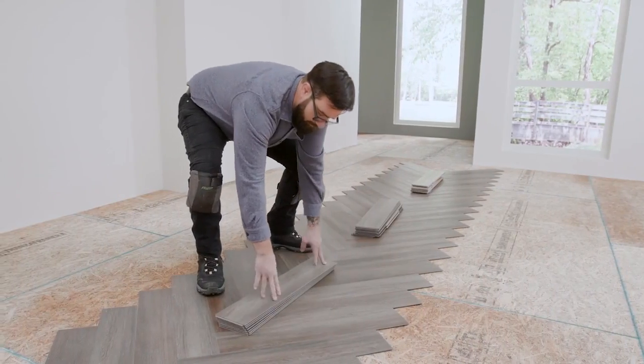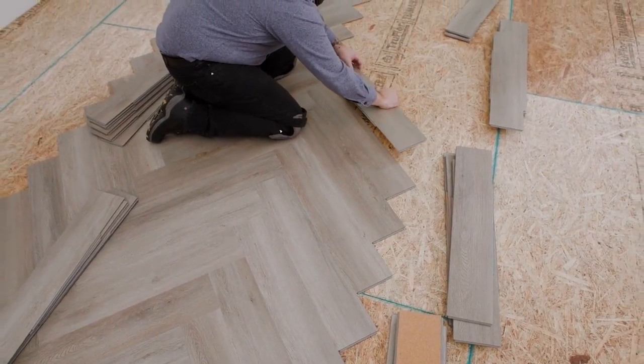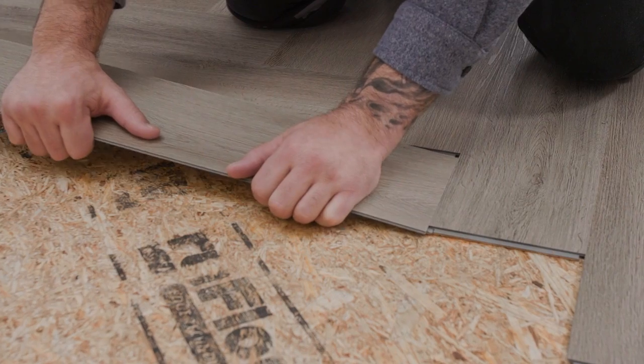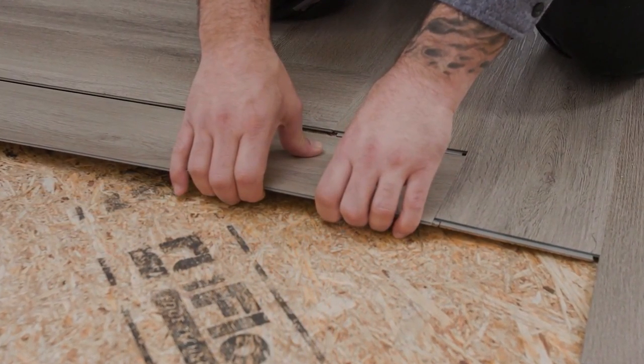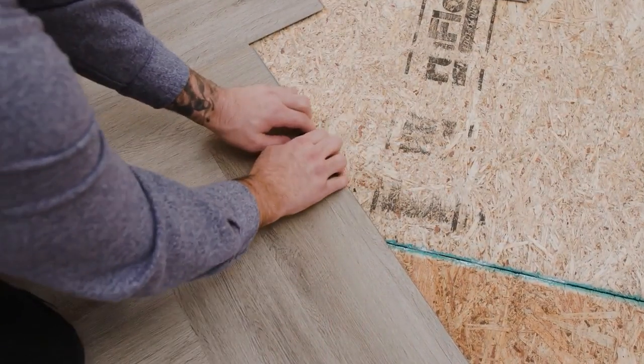Place the remaining flooring on top of your installed section and continue the installation one row at a time, first up the room, then down. The method is to install the end first at an angle of about 25 degrees, lowering, and then lifting the far side to an angle of about 25 degrees and pulling the side joint together prior to lowering. I also recommend installing the perimeter cuts as you go.